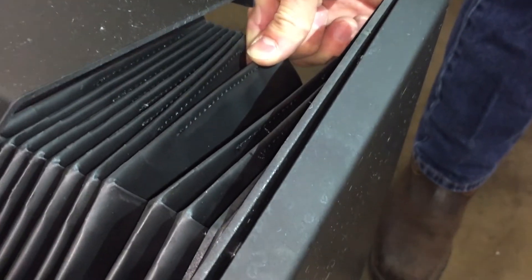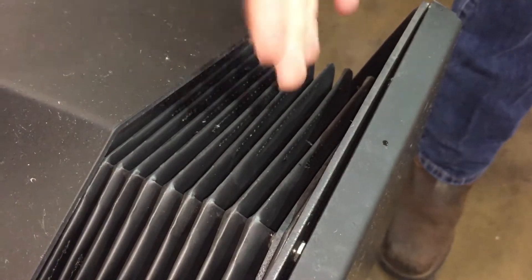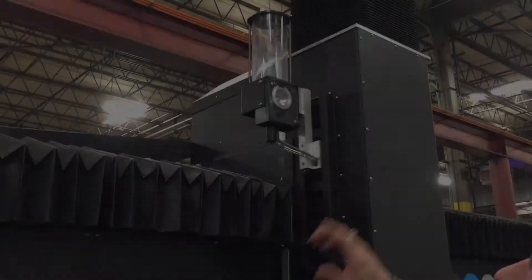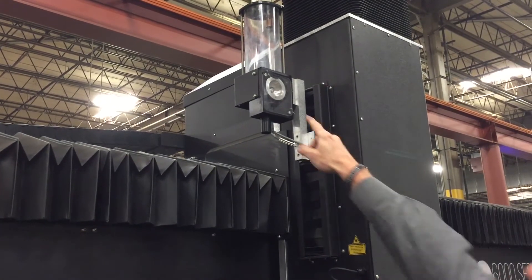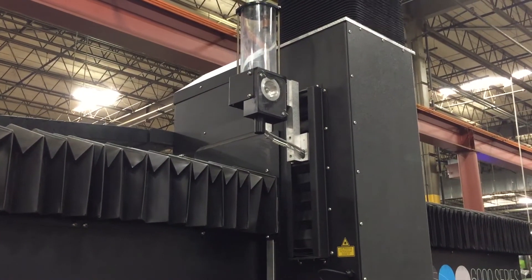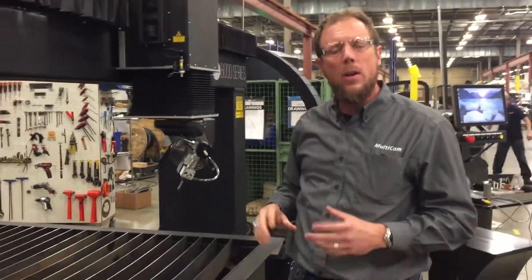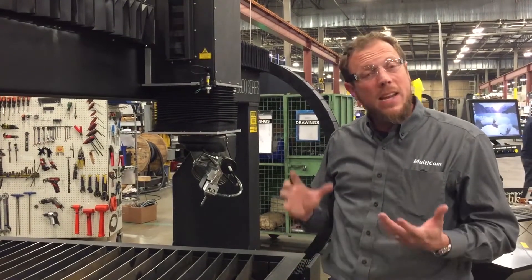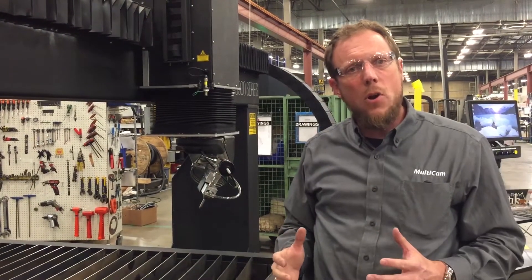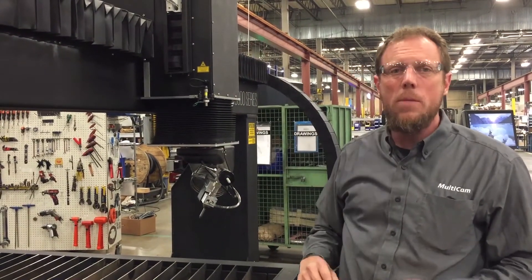On our machine, we've got fully stitched and supported reinforced bellows all the way throughout, making them super tough and resistant to the abrasive in the waterjet process. We've also got a garnet feeder with the capability to dial in your garnet usage — whether it's 0.8 pounds a minute, one pound a minute, or half a pound a minute. You want to dial that in because garnet is your number one cost in waterjet. At Multicam, we care about your cost per foot of cut.